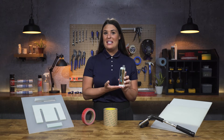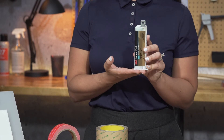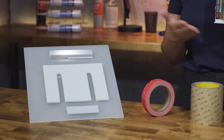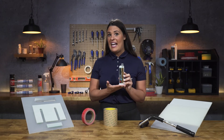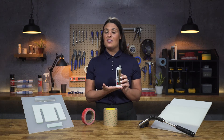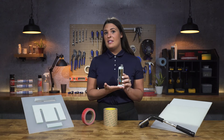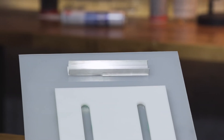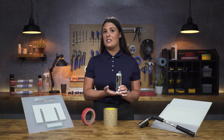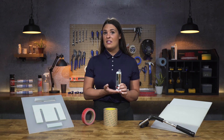Last on the table, we have 3M DP 8010. 3M DP 8010 is an acrylic structural adhesive specifically designed to bond to very low surface energy materials like HDPE and other compositions of polyethylene. 3M DP 8010 actually bonds through diffusion adhesion. Diffusion adhesion occurs when supercharged ions in the adhesive react and begin to alter the surface by swelling. As the swelling dies down, you're actually bypassing the wet out process, thus creating a strong bond. 3M DP 8010 is also available in a higher viscosity version, which is helpful when you want to apply the adhesive vertically without having the adhesive run down the substrate.